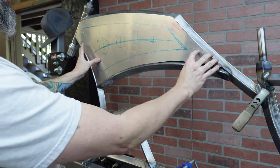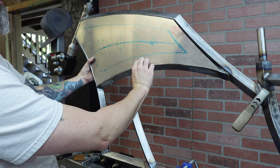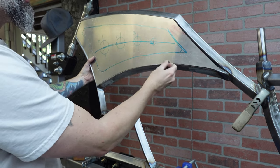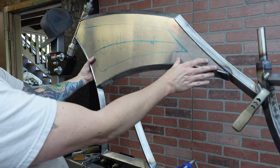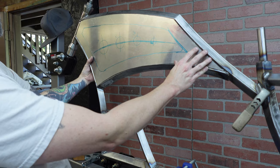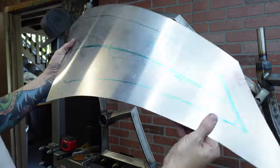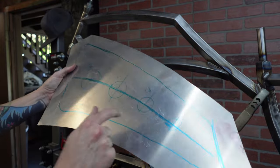Down to a 1-inch die there, and we're going to bead roll around it, leaving enough room for the washers that I'm going to use. They're countersunk washers, but yeah, that'll sit in there like that. I may have it sit kind of off the body, do a little bit of spacing, but look, I'm going to show you how thin this is. Watch what happens after I bead roll this.